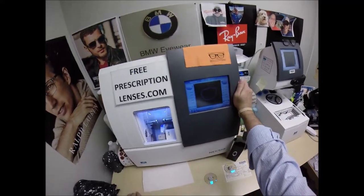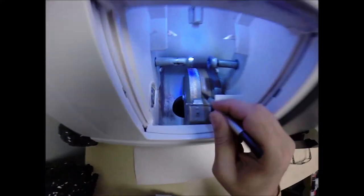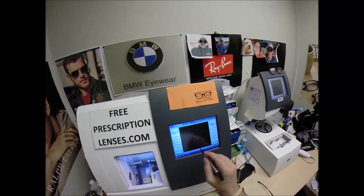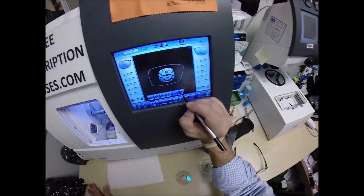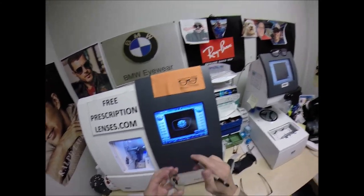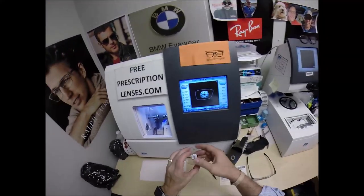Now this is the edger — this is what's going to do all the work while I run my mouth. It costs $40,000, it weighs 200 pounds. The actual cutting wheel is a diamond-crusted wheel that's going to grind away your lens material until it's the final size. This wheel in the center is going to put the V-shaped bevel on the lens — the knife-like edge to stay inside the bevel of the frame. These are polycarbonate lenses. I'm not going to polish the edge because it won't be seen in this frame. I'm not going to put a safety bevel on the front convex surface, but I am going to put a safety bevel on the rear concave surface. I'm also going to take this down a tenth of a millimeter in advance — I've cut enough of these AirDrops and know the deeper bevel.